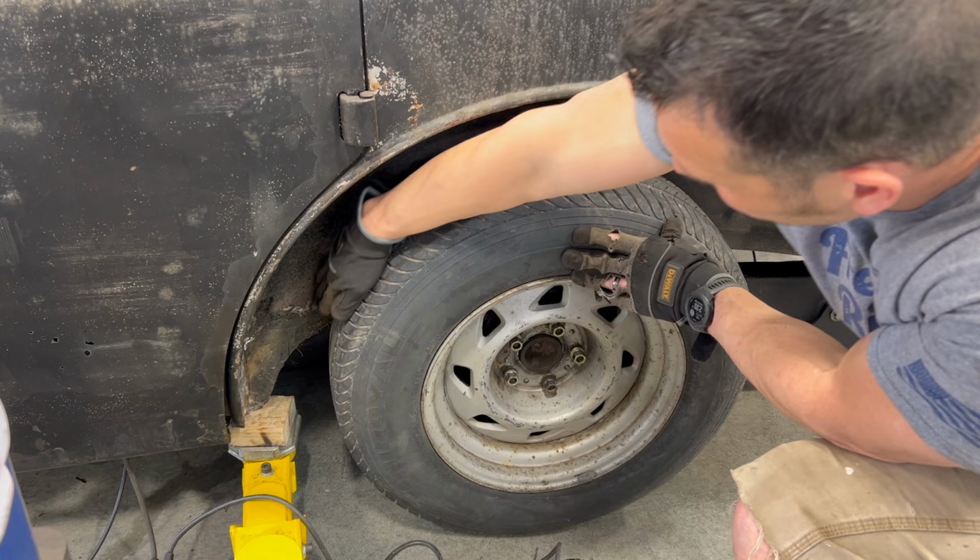Okay, so before I jump into doing things, what I'm getting at here is you can see how tight the wheel is to the inner fender well. That's because the chassis for the S10 is actually more narrow than what the Master was. So I could get different offset wheels, push that out, but then it doesn't fit on the inside of the outer fender. So I think I'm gonna stick with this wheel that's on there, but because that's running into it,